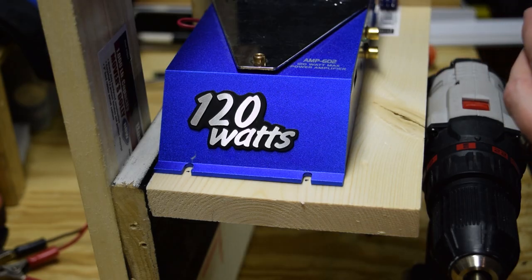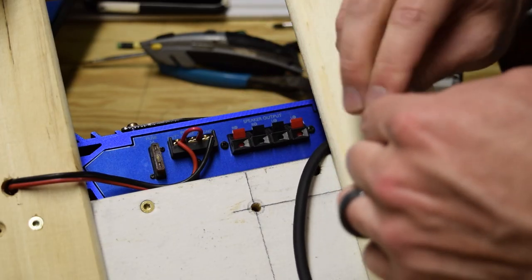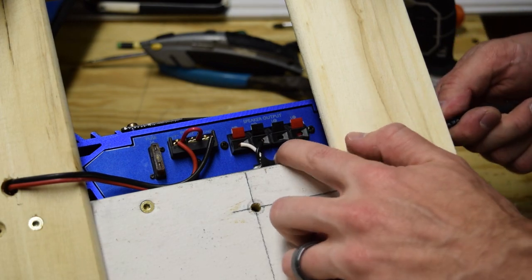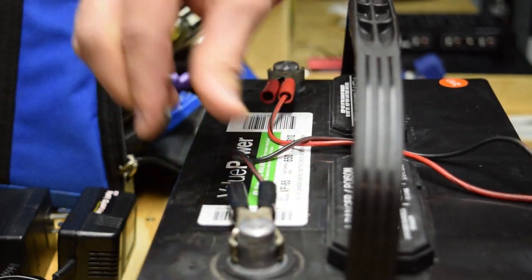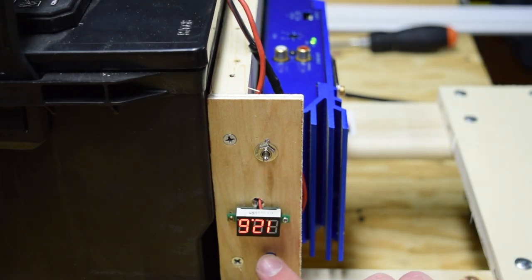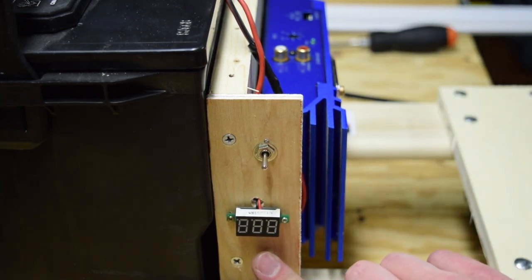Now I'm going to permanently attach the power wires to the amplifier — red to red and black to black — and connect the speaker wires. Make sure to use some strain relief to ensure the wires don't get pulled out on both the speaker and power sections. For the moment of truth: connecting positive to positive, negative to negative, turning the main switch on — we've got power. Pushing the button shows 12.6 volts, then releasing it and turning off the power confirms the meter shuts off so nothing accidentally activates it.